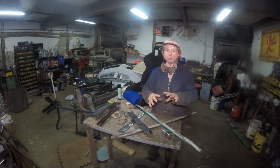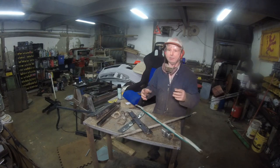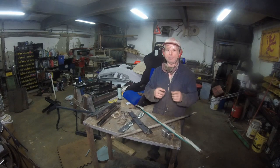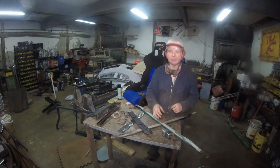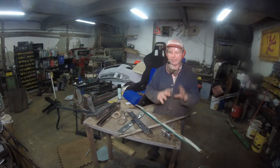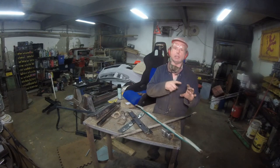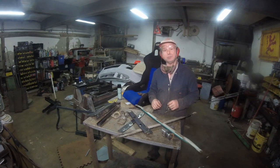Because you have to have dispersion plates on the side of the chassis, like on the floor pan. You have to remember, welding this small section to the actual floor pan without a dispersion plate, you're just asking for trouble, because all the force is right around a very, very small area, and plus you heated it up and kind of crystallized it with the weld. But the main thing is that if you put a big plate right there, you have all this welded surface area, and if you take a hit, it disperses the energy throughout the entire thing, not in a small concentrated point. At least that's what it was always told to me.